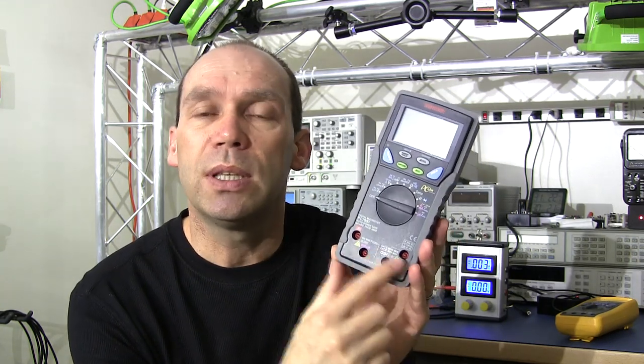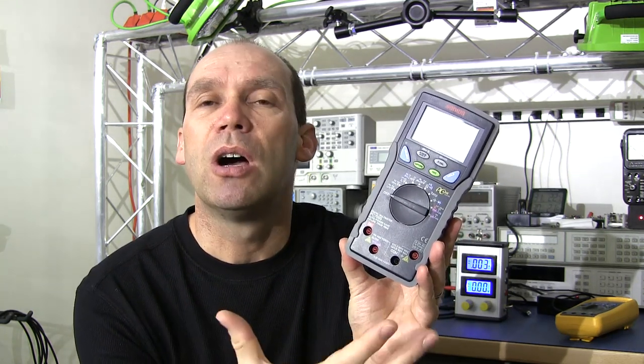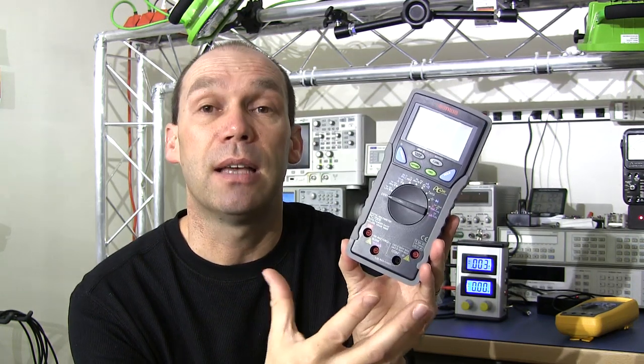It's not just measuring capacitance or resistance — you can get individual voltmeters or ammeters, but a multimeter does multiple measurements. It almost assumes it's directly measuring current, capacitance, and resistance, but actually it's not. On a very simple level, all it's measuring is voltage, and once you understand that, understanding the issues with burden voltage becomes much easier.